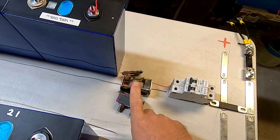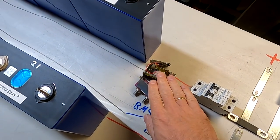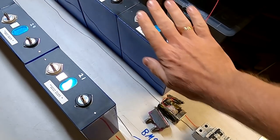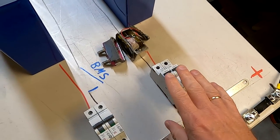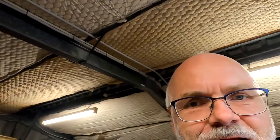What we cannot forget is our BMS. I think the QUCC BMSs are really well designed for exactly this purpose because they are now using a reliable relay to switch off the power to or from the battery. The BMS always should come first — if the BMS turns off, it shuts down the whole battery bank. Or I can do it manually by flicking the breaker and the whole battery bank shuts down.